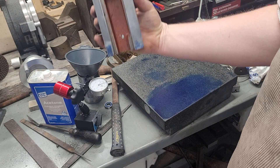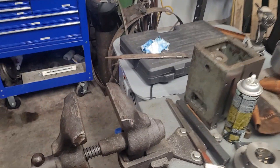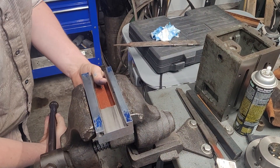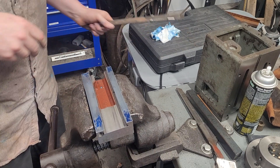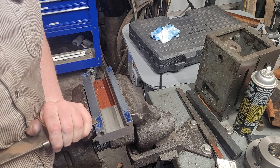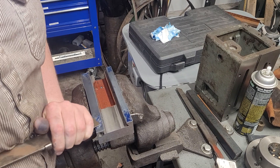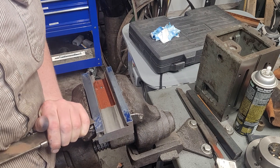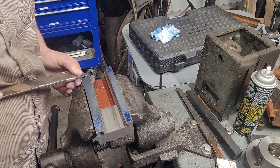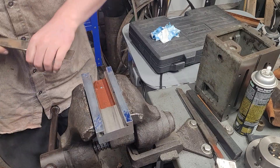I slide it on and I like to spin it, because this helps average out any errors in the plate. We got a little more blue on it — it's easier if I look through the lens. It's really just trial and error, and I find this to be quite relaxing. It's a nice break from some of the hot, faster-paced, high-energy stuff. Just take your time, don't rush, because you can always take more material off.